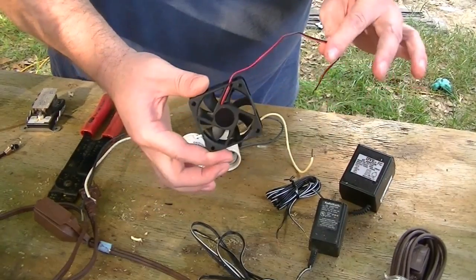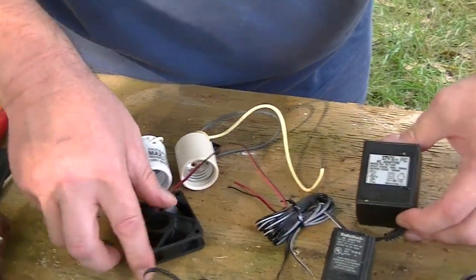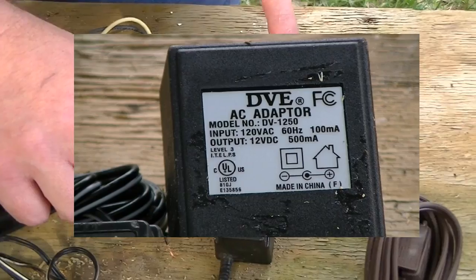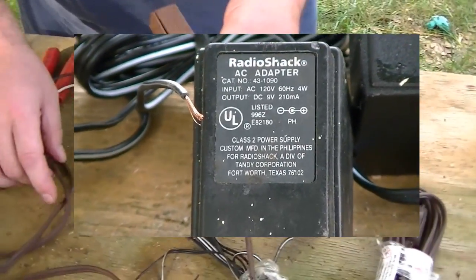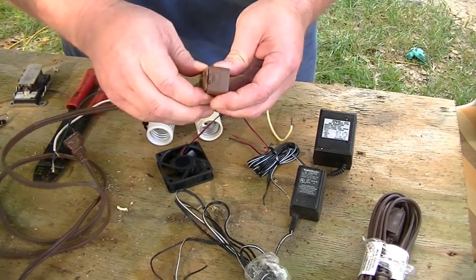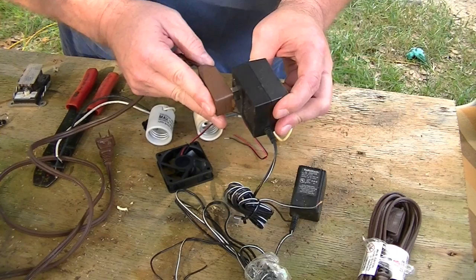Other than that, I've got a new 50-millimeter computer fan that'll work in just about any box you want to build your incubator into. You'll need an AC-to-DC inverter to drive your fan. That's one of the primary reasons I like using this extension cord — we're going to cut it and re-splice it, then use it to plug in all accessories, including a modified turner. There are three slots where things can be plugged in to drive your fan and so on.